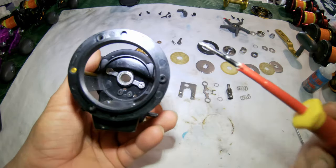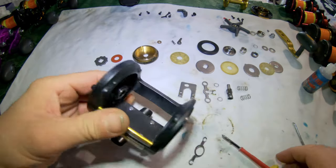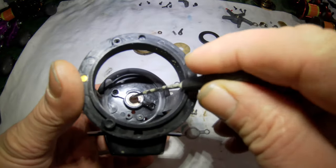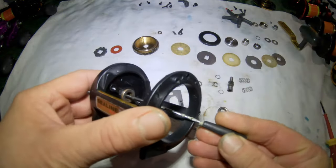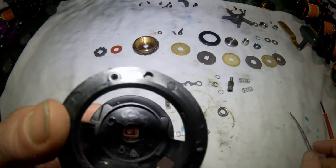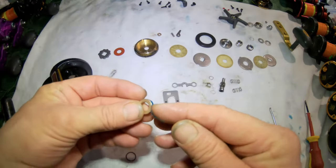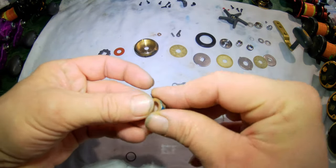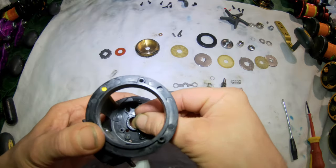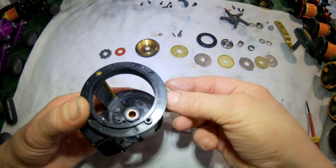Last thing is to get to the pinion bearing. Remove these two screws inside the cage, then pull the bearing out. Inside there's a brass sleeve and a little metal washer — take those out and clean them up. Clean the insides, re-grease, and then fit the bearing back in. Only apply a small amount of grease on the outside edge — we're just trying to help it turn. Lightly grease the metal bush, push it back in, place the little metal washer and oil the bearing.